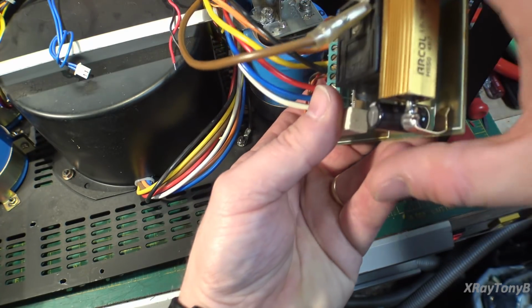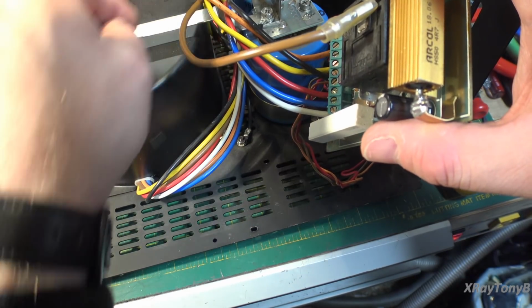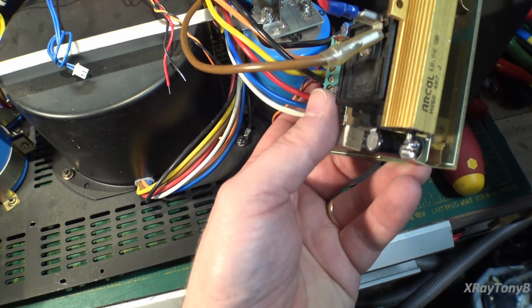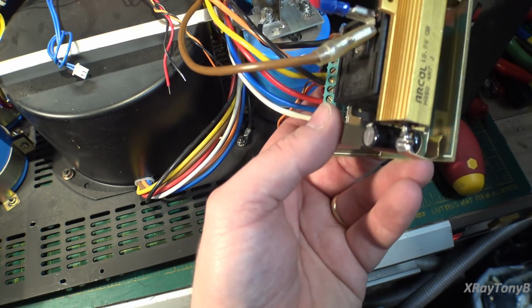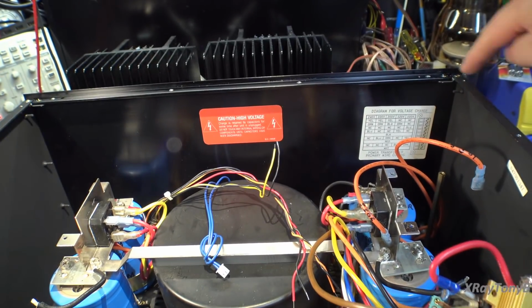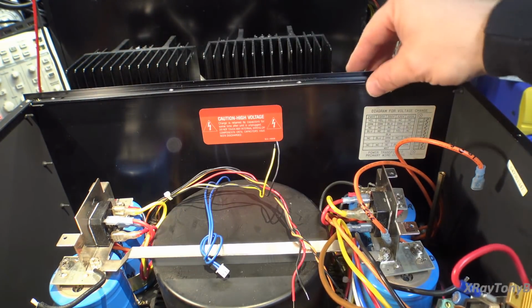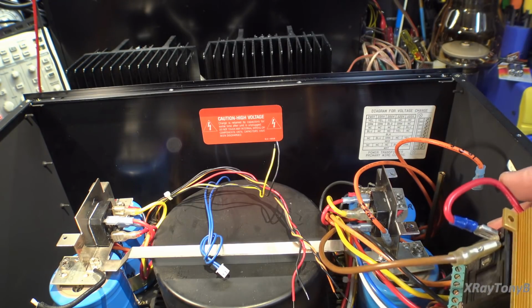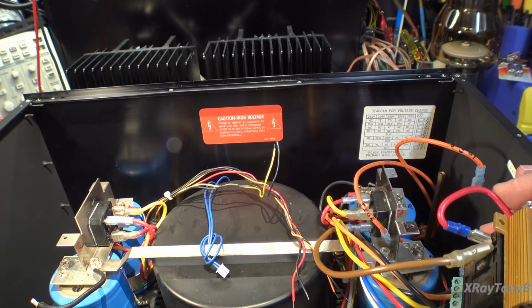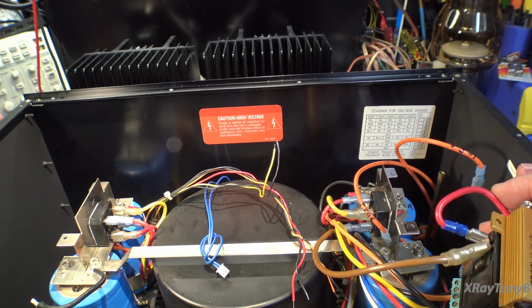We're going to hook everything back up now. I checked all the LEDs, they're all good, because this front panel is really easy to remove. Just 4 screws on the bottom and 2 screws on the top, if I was in frame. 1 screw here, 1 screw here, and then 4 across the bottom. This front panel comes off, and I put a new power switch on it just for good measure, and we're going to give it some power now and test it.